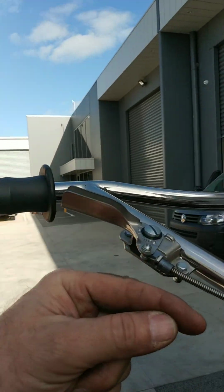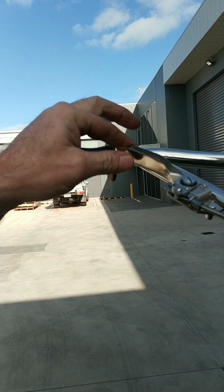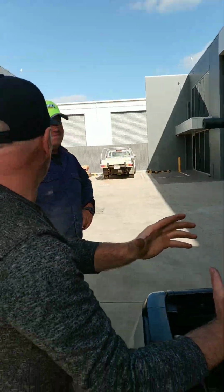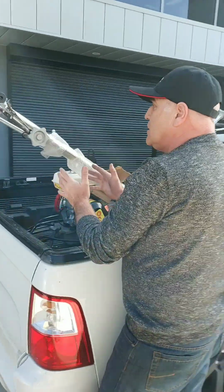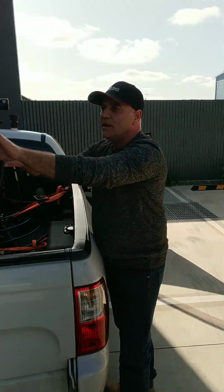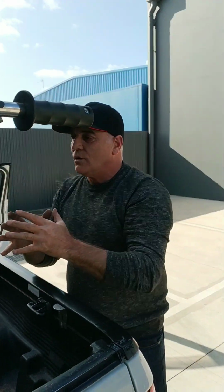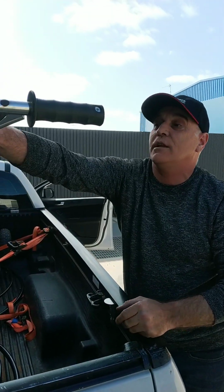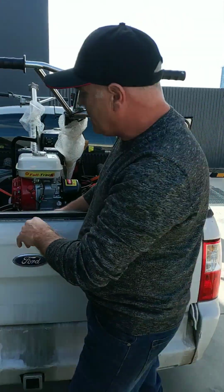The throttle cable is completely made out of stainless steel. Inside is a Teflon coating, so it will always operate smoothly. Why we need this? Because in our machines we have a variable speed. The speed of the machine can go from 40 till 200 and is completely controlled by the throttle. So this is why this always needs to work smoothly. And honestly, we never need to change the throttle cable. Or maybe if they hook it, but never need to make a new throttle cable.